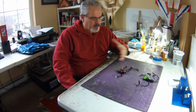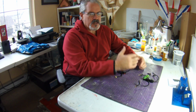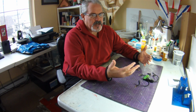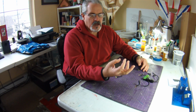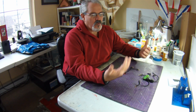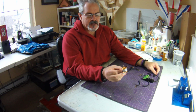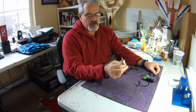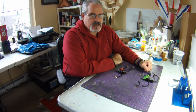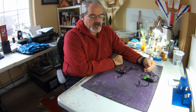But I'm hoping what I've given you in this video, as well as the blog post, will help you, because the one thing that's a bit of a double-edged sword, I'm finding, wading through all these quad racing motors, is that the selection, based on size, stator size, KV, price, and brands, is actually quite staggering, which I guess to a certain extent means you've got a wide variety of choice. With these 2212 size motors, you've basically got the no-name brand RC Timer sells one, and then of course Hobby King, and outside of that you don't have a whole lot of brand names. Whereas with these, you've got tons and tons of choice. But that makes it difficult, because it takes a little bit more research and experimentation.